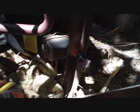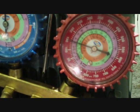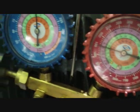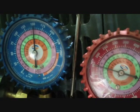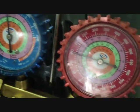I made the repair and I'm testing it with nitrogen. Doing a little spray bubble test on a couple of trouble spots at the end of the cap tubes to see if anything's leaking — didn't look like it. We got 150 pounds on it, so we'll see how that holds. Then we can pull the vacuum and start recharging this thing and get it back into business.